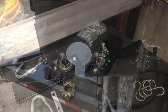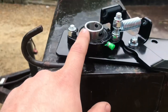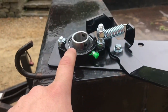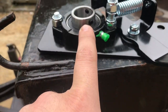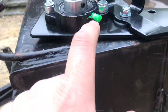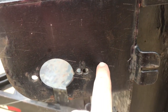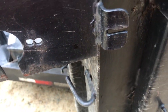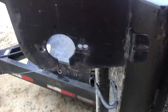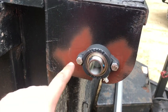My trailer already has these cutouts up front for these bearings, and the holes are real close to fitting these. So what I'm going to do is take everything off of these brackets on both sides, mount the bearing directly to this piece, then measure that same distance to keep the lock assembly and drill the hole in there for that. These don't really fit that well in place — I'd have to cut that bracket off — same on the other side. There's really no good place to put them, so I'm going to take that piece off and start from scratch.